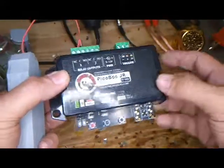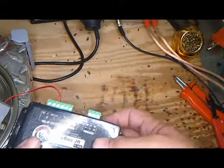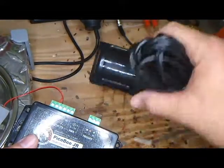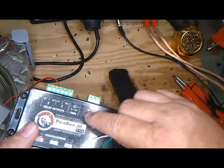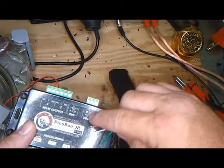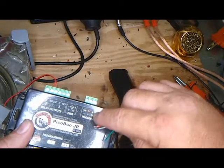So now this makes it pretty easy. You can use a bunch of the motion sensors — the standard trigger, which I just got out of the box. Most of you guys are familiar with these. They're pretty straightforward. They have four color wires and a wiring diagram. The black and white go here, the red goes in the center — that's the power.